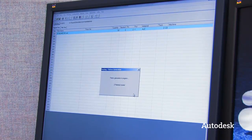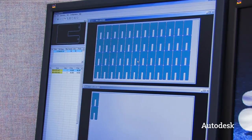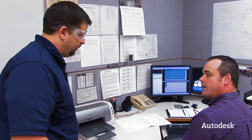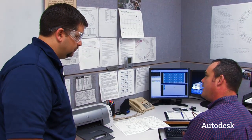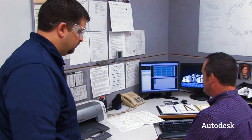I take that flat into my nesting software and if I'm happy with the way it nested — you can bring multiple profiles into the sheets. I'm getting clean geometry out of Inventor. I don't have to sit there and wonder if the geometry is going to come in, or if I'm going to have to do any cleanup. I'm nesting parts, I'm making parts. So you can go from engineering to flat to DXF to nest to machine in what, an hour? Probably less than an hour depending on the part. If the machine is already set up to cut that material, in a lot of cases less than an hour — 15, 20 minutes for making parts.